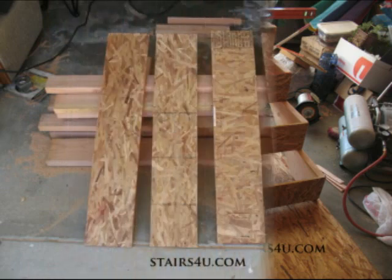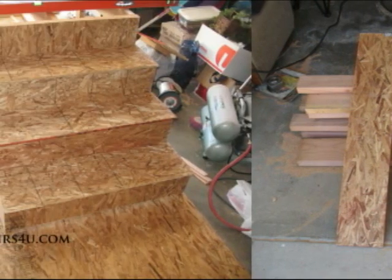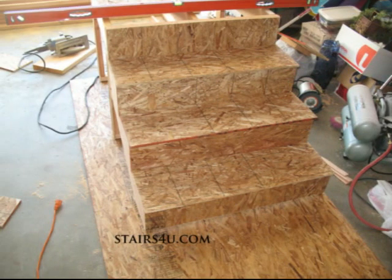If you are cutting your risers, you can actually cut them with the grain of the plywood or oriented strand board, or perpendicular to it. You cannot do that with treads, since the stair treads are going to be sitting on top of and supporting most of the weight — sitting on top of the stringers. This would be the same thing you would have with floor joists and roof rafters. The grain of the plywood, the grain of the OSB, needs to run perpendicular or cross over the roof rafters, the floor joists, and the same thing holds true for the stair treads.